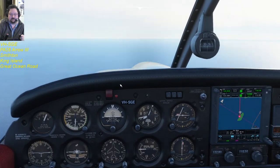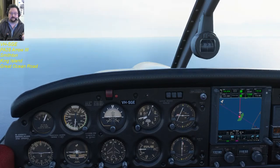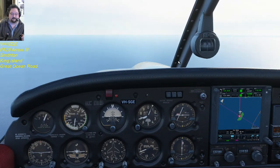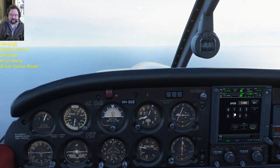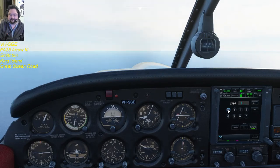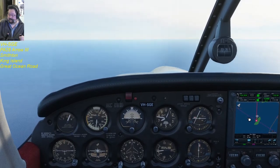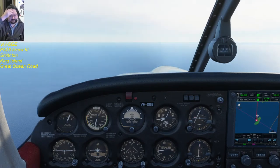So they'll give us probably a squawk code in that case. Whatever that squawk code is, pick it up here. And it wouldn't be 1200, it'd be something else, say. Something like that. And then we'll call it in again in 10 minutes, on the hour, on the tens, on the zeros. So 10 minutes, 20 minutes. And then making landfall again at Cape Otway.